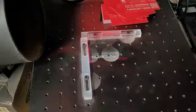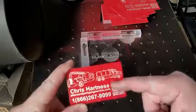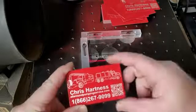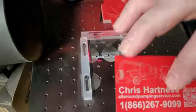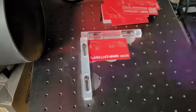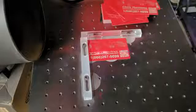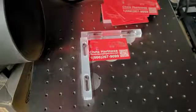There's one parameter I forgot to change this time around — the line interval. Before I was shooting 0.03 millimeters; now I'm shooting 0.1, so it's much further apart, and I've got to tell you it shows. I'm seeing a little bit of untidiness around the very edges, like the E's and the S's. So I'm going to go ahead and tighten that line up. This will add a little bit of time to the burn, but it will make the burn nicer, and I'm okay with that.